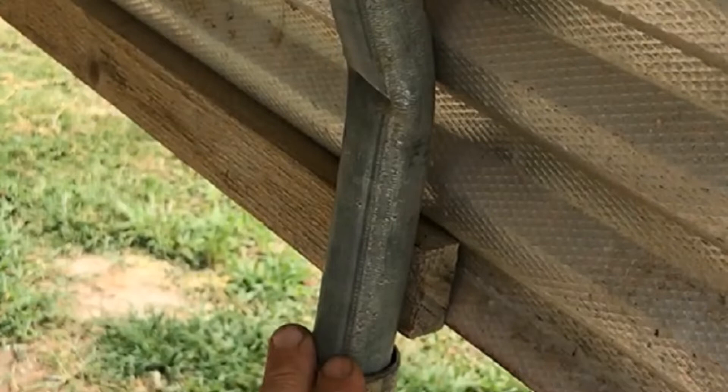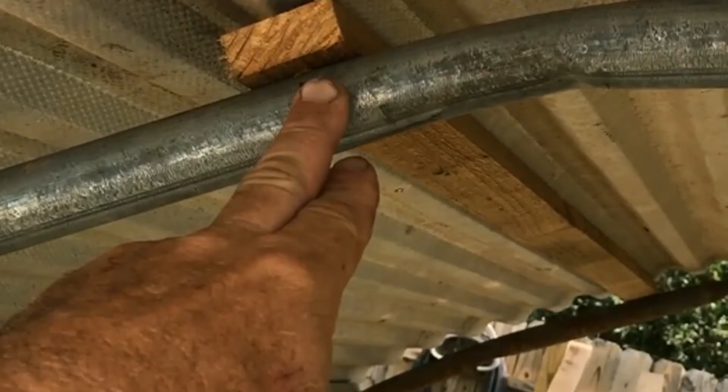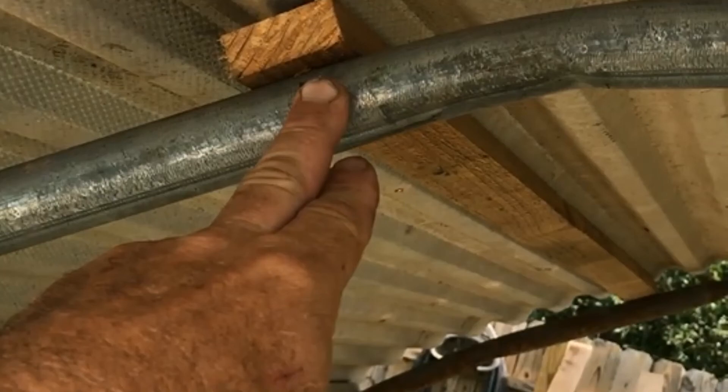After inserting the arches into the corner poles, I left enough of the vertical part of each end to attach the 1x2s. Once I had attached the 1x2s, I used a level and slid the arches up or down at each corner to help me level. Once leveled, I used self-drilling screws to secure the arches to the corner poles. I then attached the rest of the 1x2s around the arches at the locations where the corrugated metal pieces overlapped.